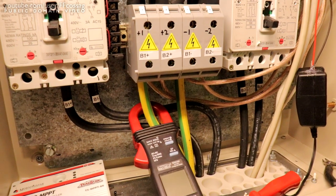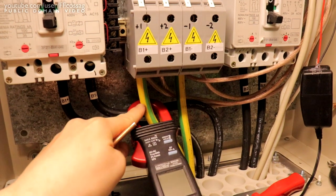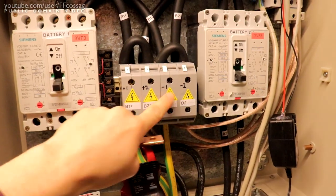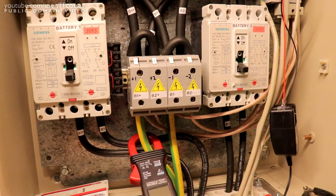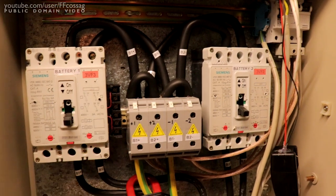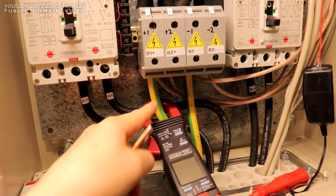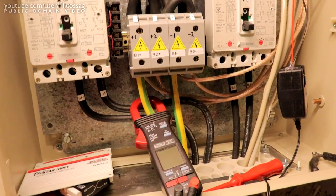Now, while that was a very successful couple of tests, these wires are not going to last, for a couple of reasons. I want to have all these terminals populated. I want to run quad wires to the inverter to reduce voltage drop. I don't want to live with these forever. And these are obviously ground wires, and they're just 70 square mil. 70 square mil is good for about 210 amps-ish.